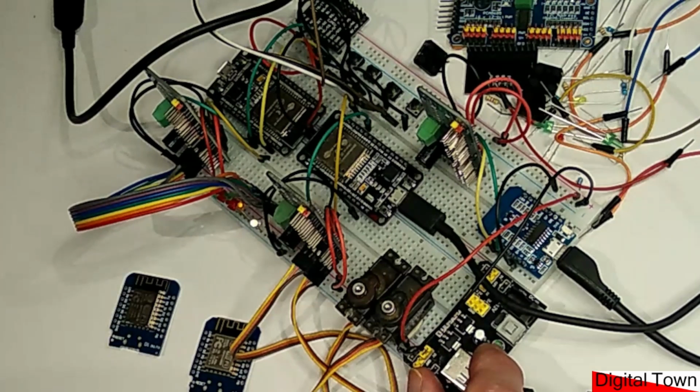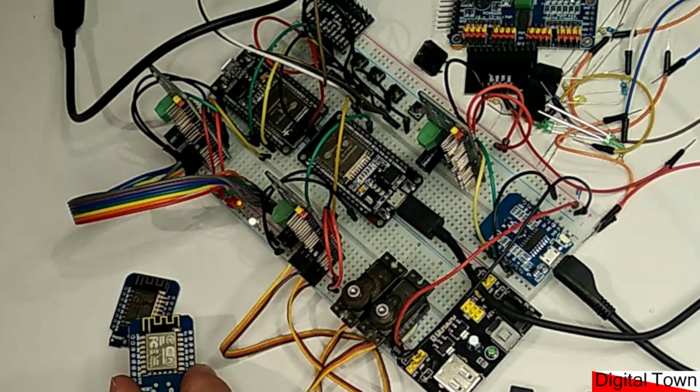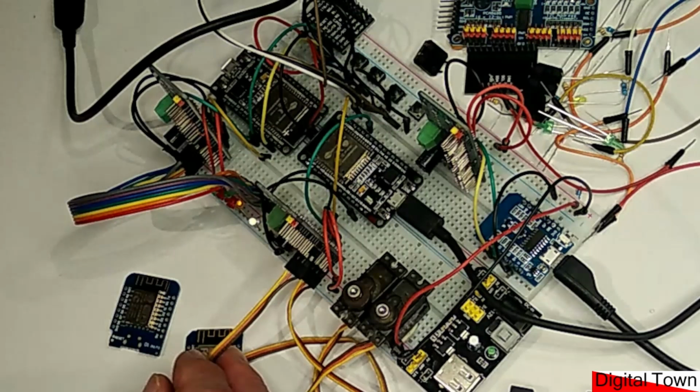You play with it, but don't forget, especially if you're doing wireless or Wi-Fi stuff, think about what else is on the network. What is going to cause interference? What is nearby? What's going to happen if the temperature changes? Car manufacturers actually have giant fridges and ovens that they run their cars in on rolling roads just to make sure that they work under different temperatures.